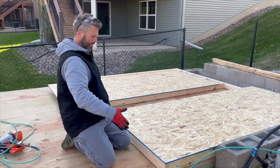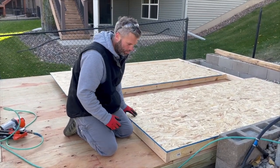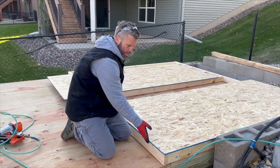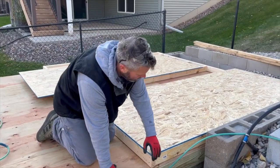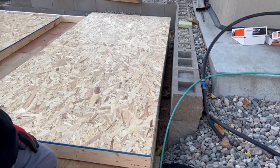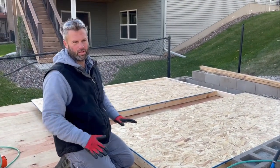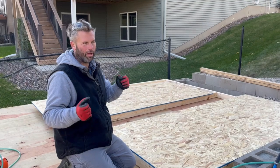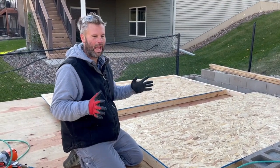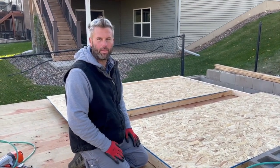We square it up with these sides to make sure that your framing is square. And then your sheeting, you just slide into place and make sure that this whole edge is flush and square, along with your other edge. It's flush and square. And as long as you do that, your wall is perfectly square. And if you do that with all 4 walls, when you stand it up, you don't have to get out your levels and make sure that your wall's standing upright. Just always make sure that if everything is flush, it will be square when you're done.